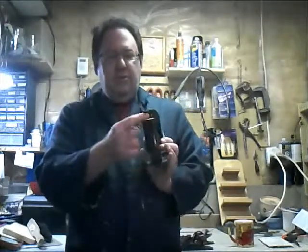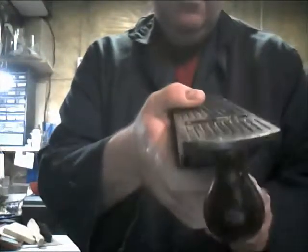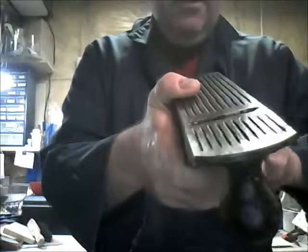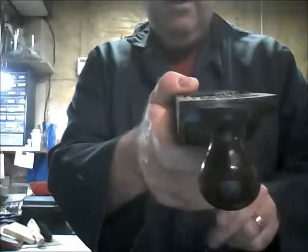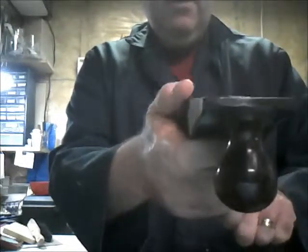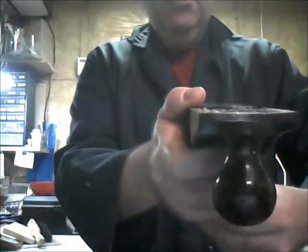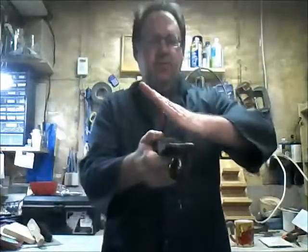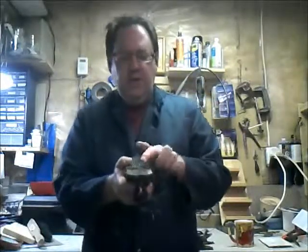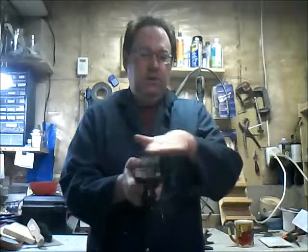The other thing you can do is take this adjusting lever, and if I shove that lever from side to side, it should tilt the blade. You'll notice — or when you do it yourself, you'll notice — that it's going to cause the blade to tilt further out on one side or the other. Your goal with that blade is to be parallel with the plane base — with the sole — so that it's parallel.